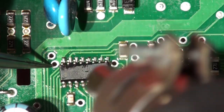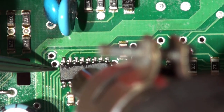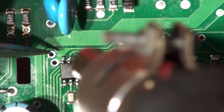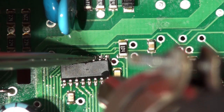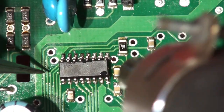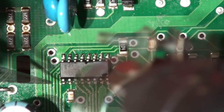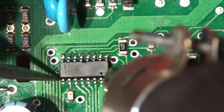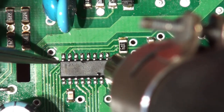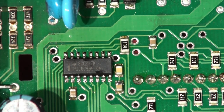Be patient, let it heat up — don't get too close, don't knock the components with the end of the blower. And there we go — come on, melty melty. A bit more down this end. There you go, just see that pull into place. Okay, good — molten. Maybe shove that over a tiny bit — a bit too much. Okay, that's how you do it with the hot air gun.